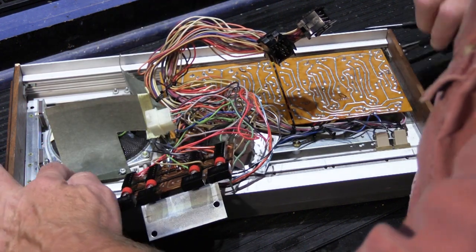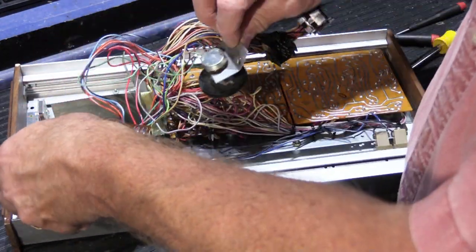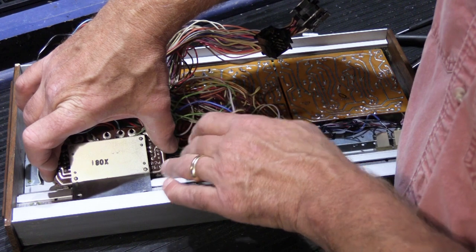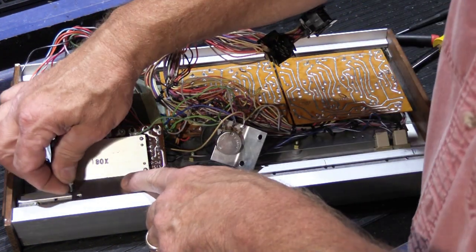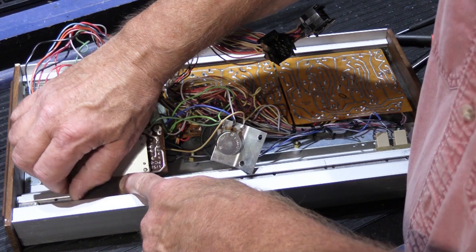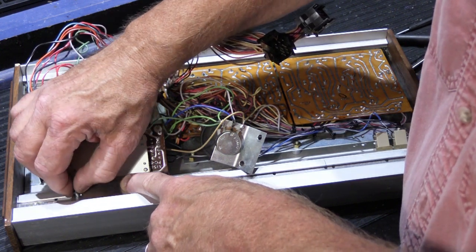Now, this is a more extensive cleaning than what most people would probably do. However, if you have frozen switches, this is what it takes. We'll take our switchboard and we'll put our button caps through the openings in the faceplate, and we'll start our screws by hand. And since we were smart, I think we were smart, the first ones are always the hardest ones.